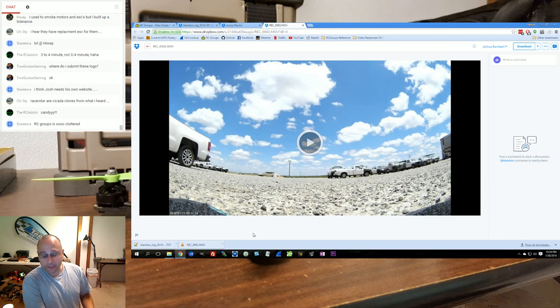multi-shot makes a difference, even at 2 kilohertz. No question in my mind about that after this test. The oscillations got significantly worse on one shot compared to multi-shot, even at 2 kilohertz. And I conclude that the motor output rate, you could do a test on the bench where you spin the motor, like Quad McFly is doing tests where you could see microseconds of difference between 32 kilohertz and 8 kilohertz. But in flight, I couldn't tell a difference. So I'm going to run my copters at either 8K synced or 4K synced, depending on which board I've got. And that's just going to be it.